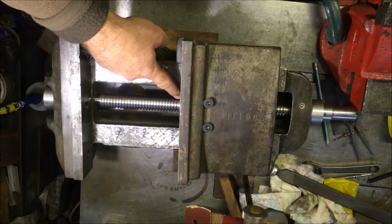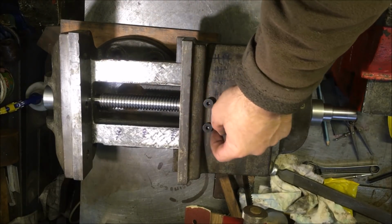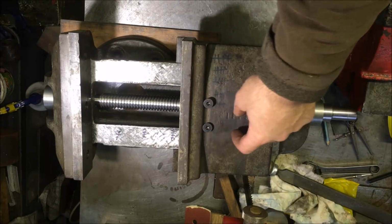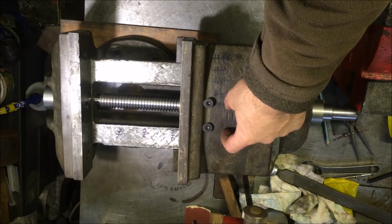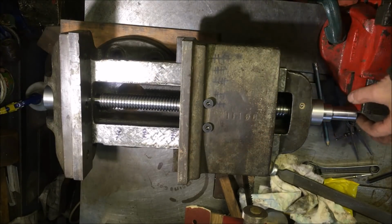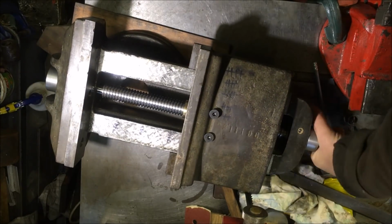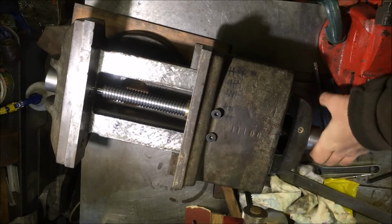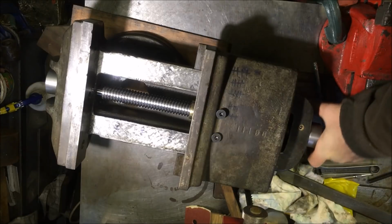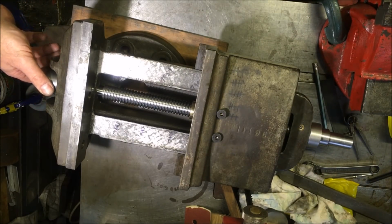You can see the bronze nut there. I've got to change those out for a pair of standard cap heads and countersink them in. I might use button heads, but they need a flat base to go onto, and then I need to do the second set of holes, which is there somewhere, and cut the flats on the shaft. But it works. Wants bedding in a bit and everything lubing up, but I'm quite happy with that. Progress is good.